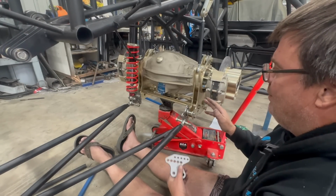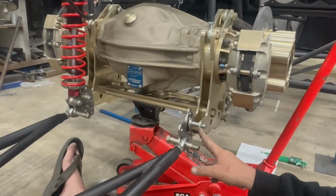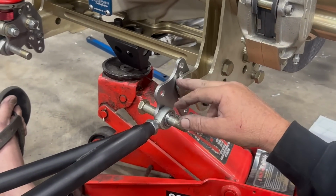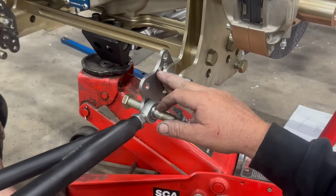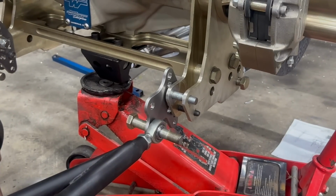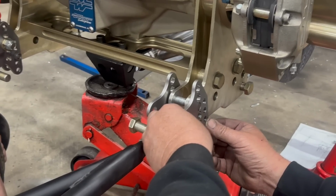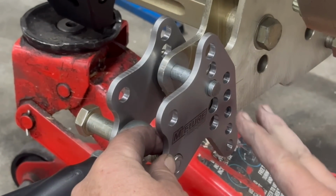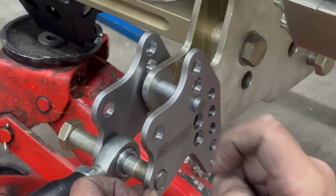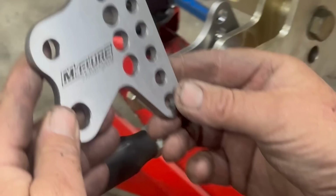Okay, with all the ARB locked away, we're moving on to the shock absorbers and wheelie bar mounts. Now with this modular diff, it comes with 2 bolt holes, one for the wheelie bar mount and one for the shock mount. Now we want to have adjustable shock mounts on the car so we can muck around with the ride height. So we got talking to a good friend of McClure Motorsports, young Brody Zappia, and he runs a similar differential as this, and he CNC'd up his own little adjustable shock mounts to go into this slotted configuration. So it adds 100 mil of adjustment, 5 holes, and then moves the wheelie bar mount out to this lower one and the shock mount out to here, and then this whole deal we can move up and down 100 mils.